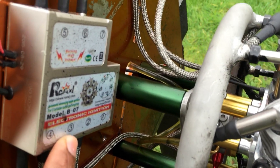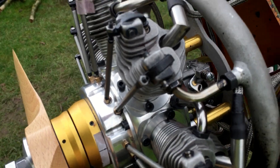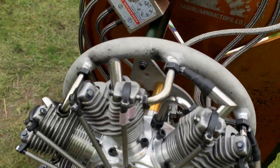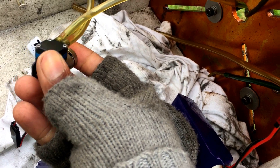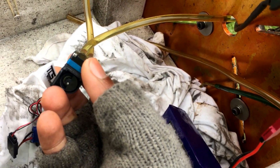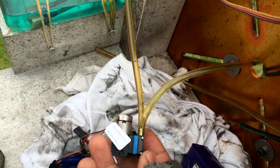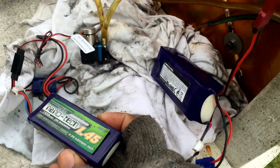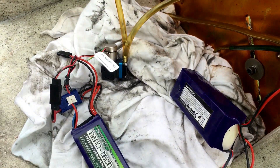Sub-sensor in the unit, one unit with one sensor coming from the ring. This engine is being operated with a very small micropump, it's already on, already primed, very quiet. It works from 4.8 volts right up to a 2-cell LiPo. I'm running a 6.6 on it, that's more than enough for what this engine is asking for.